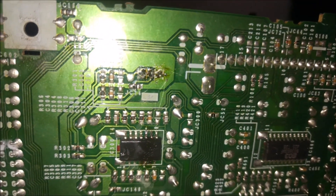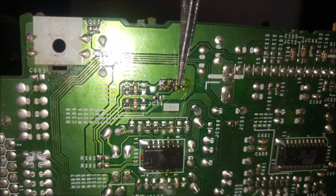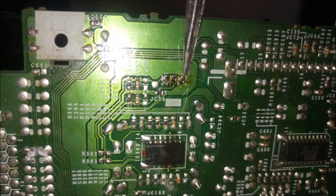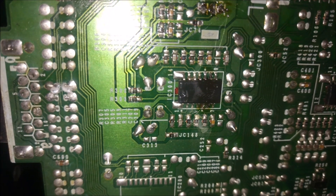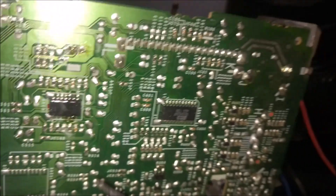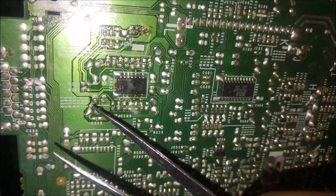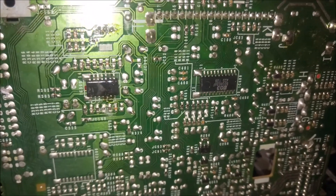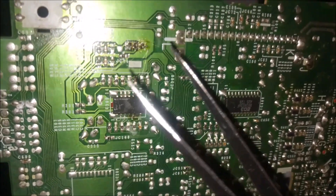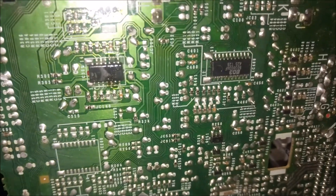So this is the last update. I was soldering my connectors between the right and left channels and the ground, but unfortunately it didn't work. I did some more research and found out that this IC is the tape equalizer IC. I found that pin 5 at the bottom and pin 10 at the top were the outputs from the tape equalizer. I soldered my cables to those pins and the volume was too low — it worked but not at a usable level. I tried getting another ground terminal and it still didn't work. Sorry for the goat noises outside. Not everything you try works, so just move on.